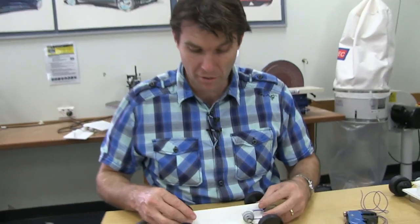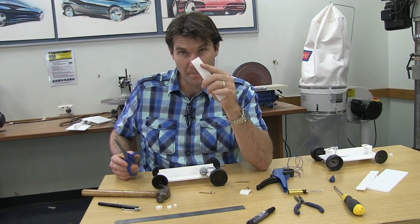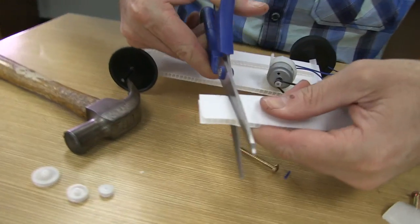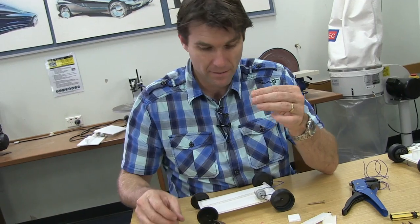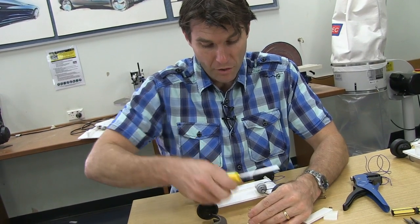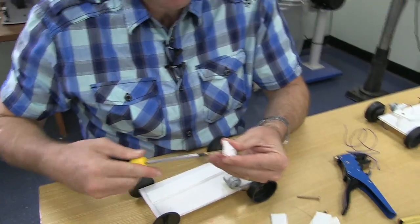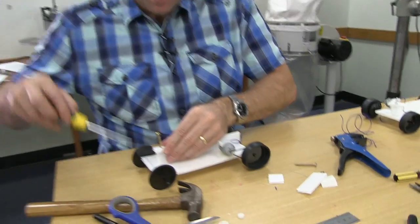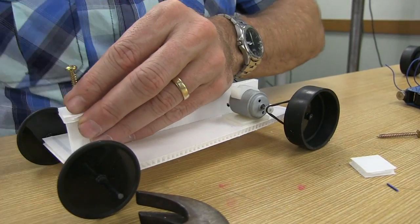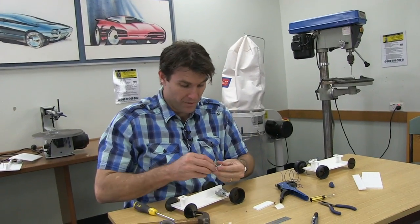Next, we're going to be putting on the rib — the rib sits on the back. We need a couple of screws to put it on. Take a piece of the core flute strip that we cut to 25mm and cut off two pieces that are roughly square — roughly 25mm square each. Take the Phillips head screwdriver and the screw, push it into the core flute and give it a twist. You'll see it popping out the other side — give it a bit more of a twist. Then put it into the core flute itself and find the centre. Wind it down, then do it all again with the second piece at the back.